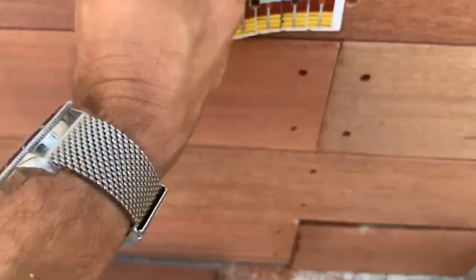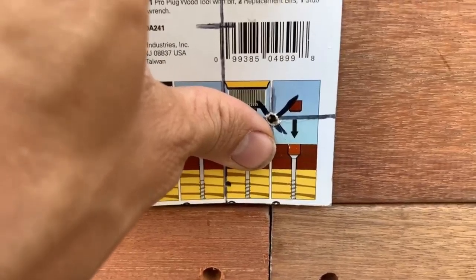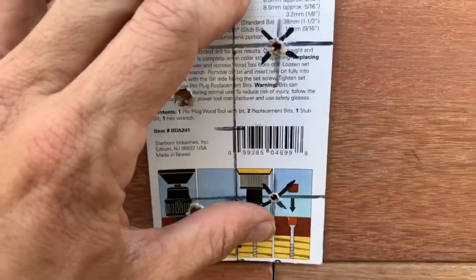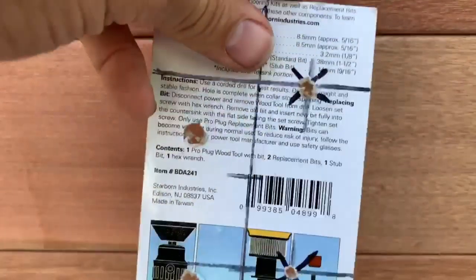It's starting to look like a fence. We're getting it screwed in. We got our first few boards in and we're laying them down. I made this little template — I just put it on the center of the seam or on either side of the board that I need to screw. If I'm going to put this as my center pilot point, I use it right on the center of the joint, tap it a little bit, then take it off and screw the holes in. If I've got boards on a little joint, I put it right on the corner. That's how I used my homemade template.